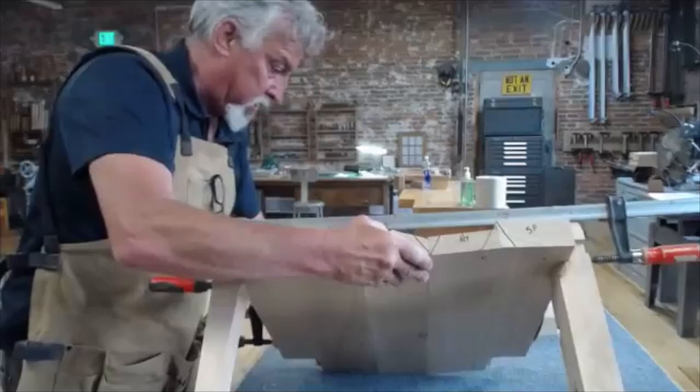These legs, when you put them on and off the chair, assemble, disassemble, carve, disassemble, because the joinery is fairly tight, there's an opportunity to chip out the wood. So what I do is I grab the bottom of the leg, use the soft part of the hammer, and take it out evenly. If you take it out at an angle, you're liable to ruin your seat material or your leg material. I learned that lesson pretty quickly, ruining a few legs. So we'll get the other leg off. So I'm literally pulling here.